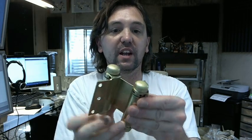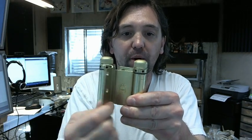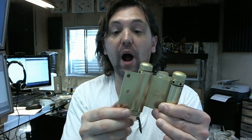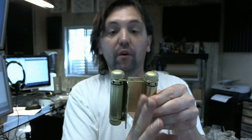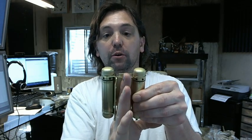Once you get that attached to the jam, the hinge will look like this. This leaf will be flapping around. Your door sets into this pocket here. The three inch size specifically means that this is intended for three quarter to one inch doors. Anything thinner, this hinge is over-engineered for in terms of the size. Anything thicker and it won't fit into this pocket.